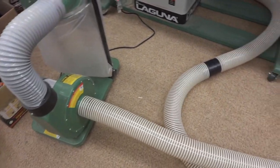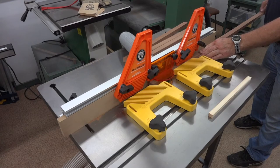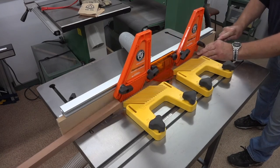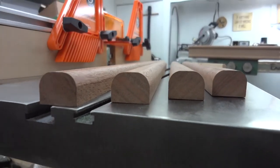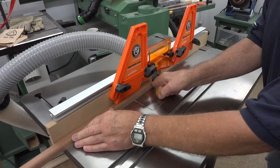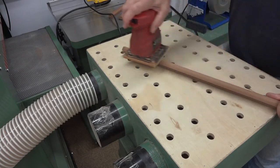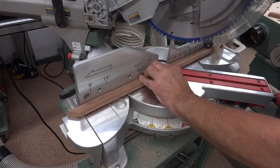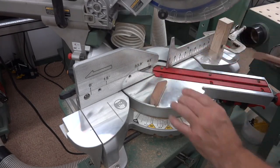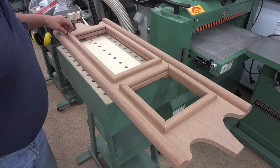As you can see, I'm really big on dust collection. Because these doors are going to be glass with mahogany frames, I have to rabbet out the mahogany here where the glass is going to go. These little pieces are easier to sand now than after they're all assembled. I've already got the length figured out for each piece, and now it's just a case of cutting the 45-degree angles for the corners. And here I'm just laying them out to make sure that I really did get them right, before I go to all the work of gluing them together and find out they're wrong.